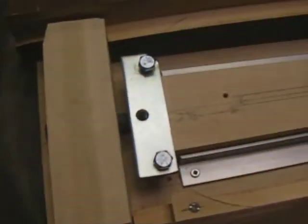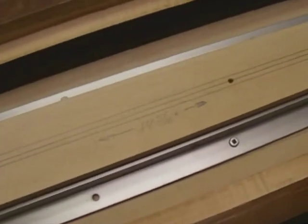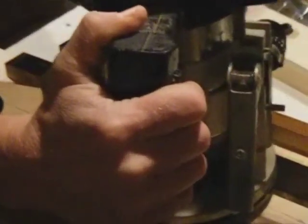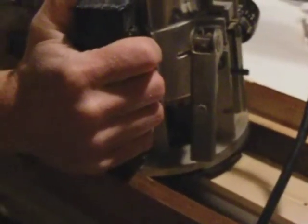Here's a shot with the neck in place ready for the route. The heel clamp has two configurations — you'll see one where I'm coming in off the end and using a block off the back, which gives a little better control. Here we're seeing a few shots of the routing process, working the initial pass. You may want to pause the video to see what I've done with the clamp — that's my alternate configuration.